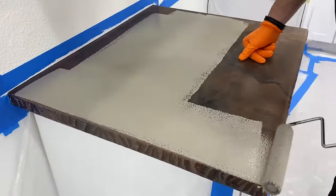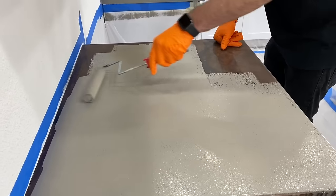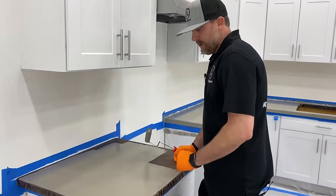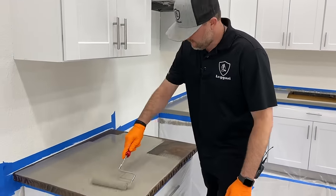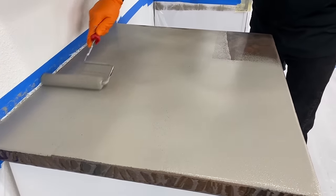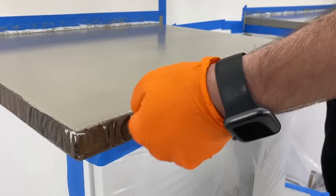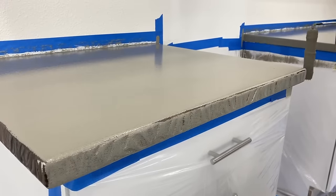If you're going over an unsanded or Formica surface, you might roll out the primer and it'll separate in fish-eye spots from contaminations or silicone residue. Let the primer set up a little, and when you re-roll when it gets a little tacky, it'll fill those in. Don't worry about that — just keep priming and come back after the primer's set a bit and re-roll those spots. We did the decorative edge here — we've already coated over it once, so we're just going to coat over it again. It'll fill it in more but you should still be able to see it.